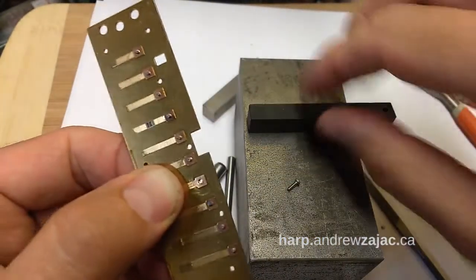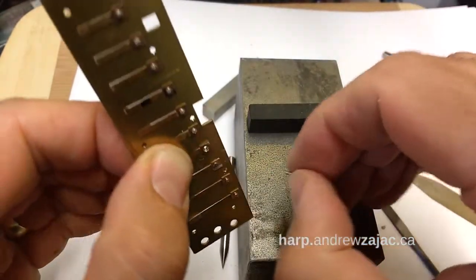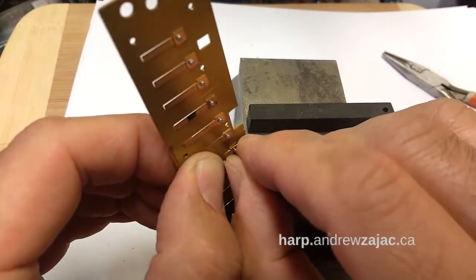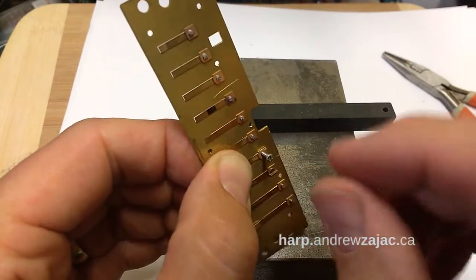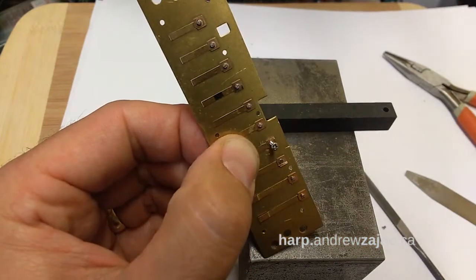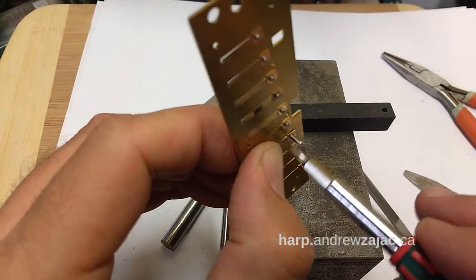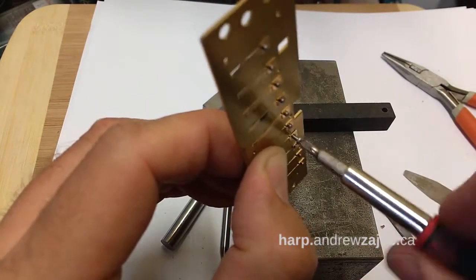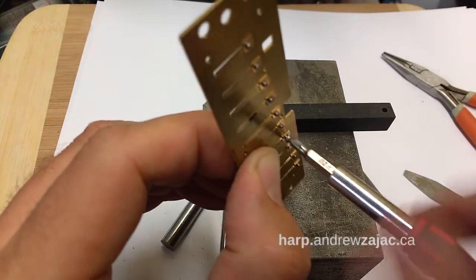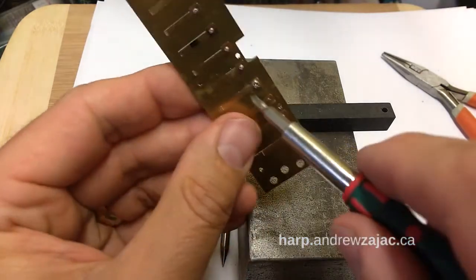I'm just fetching these. These are 5mm long M1.4 screws. They're 5mm long so that you can put them in with one hand, and you don't need a tool holder or fancy equipment. Now of course they're way too long to use. We're going to snip off the other end, but not until we're sure everything is as we want it to be.